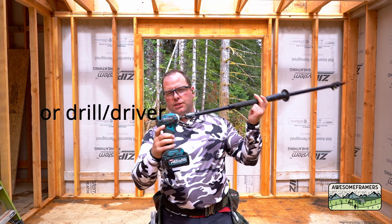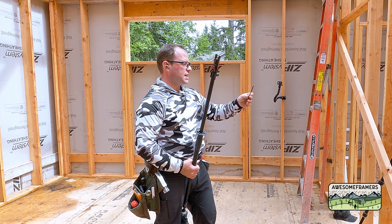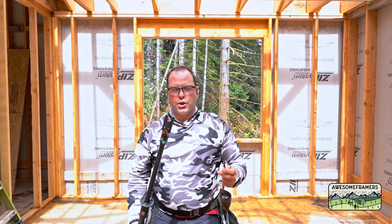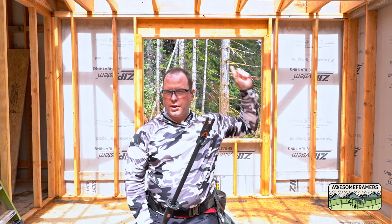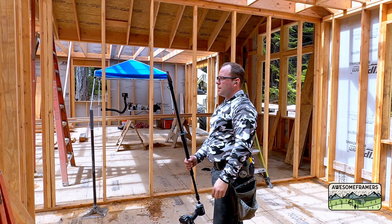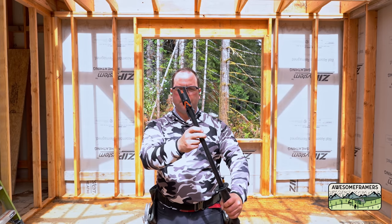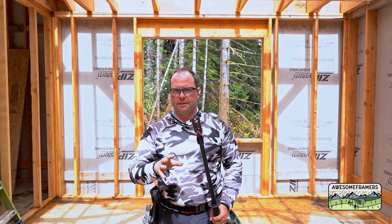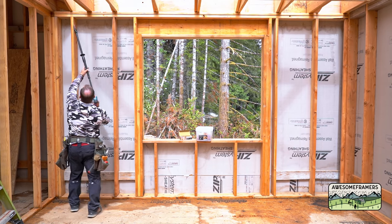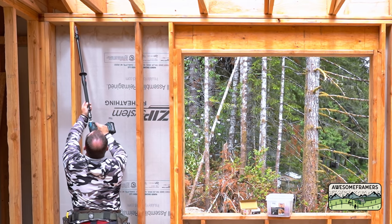The Simpson Strong-Tie Quick Stick has been designed to attach to an impact driver and drive these fully threaded screws, which are code-listed and rated. There's a six-inch and a four-and-a-half-inch version — they're different colors because they serve slightly different purposes. For the rafter to top plate connection I'm using the six-inch fully threaded screw. You drop it in, use the guides and bubble level to develop the proper angle so you get the fully developed load rating.